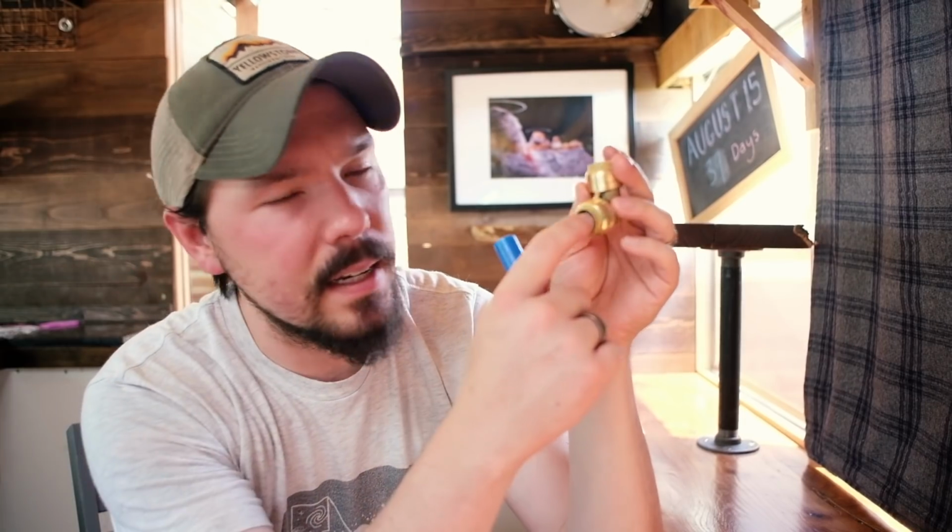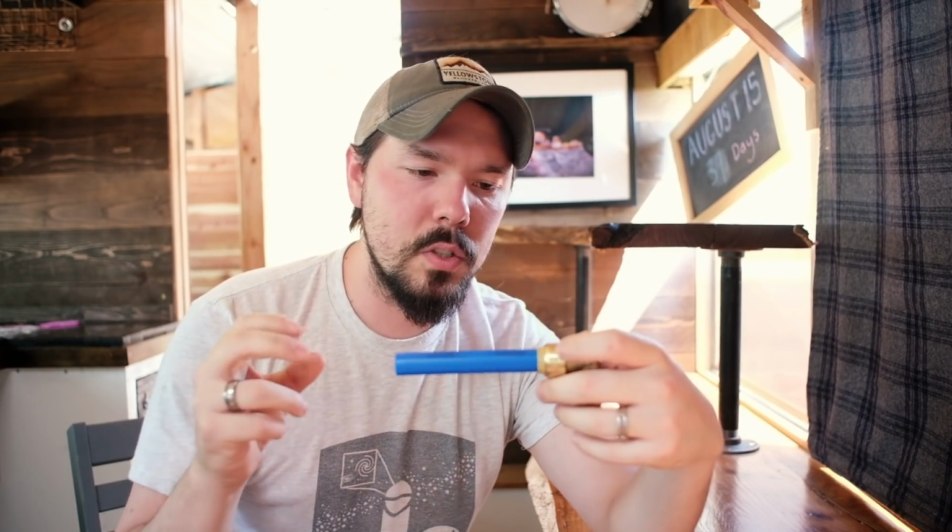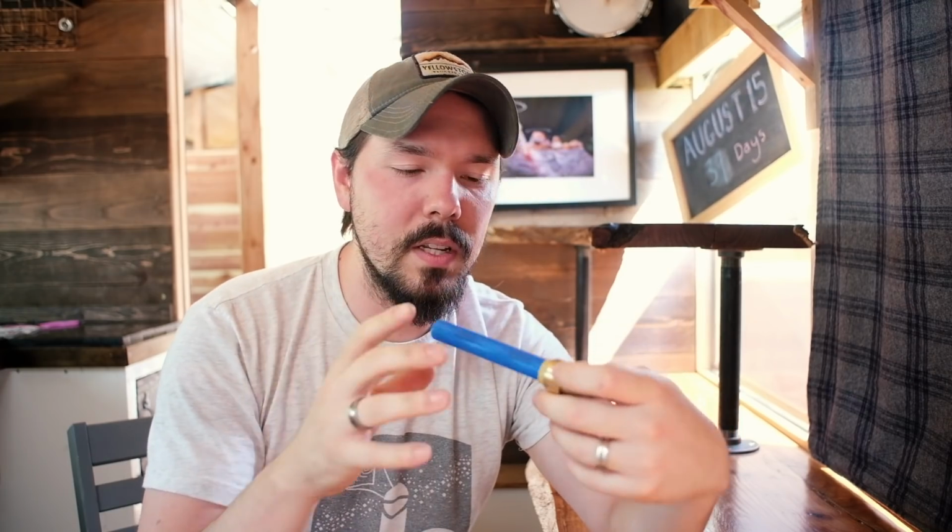And basically all this is a way for the tubing to just nest into and move water. The inside of these has a plastic fitting that actually fits inside the inner diameter of the PEX tubing. And so, very easy. Take your tubing, push it inside. Make sure it's a good fit. There we go. And you can feel a two-stage click, a two-stage nesting.